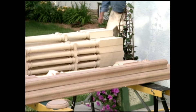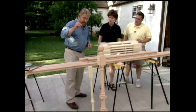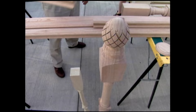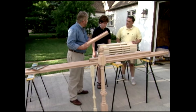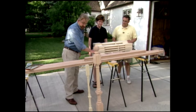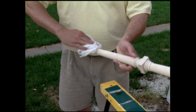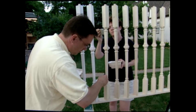I've laid out all the components for our railing system right here. There are really only three. This is a system by American Legacy. The three major components are a newel post, a series of balusters in between, and the whole thing is connected together with the railing. The newel post and the railing are in oak because you guys have a lot of oak in the house. But the balusters are actually in poplar and these are designed to be painted. As Steve and Stacy clean the dust off each piece with tack cloths, I temporarily nail the balusters to a strip of lumber so we can turn our painting into an assembly line operation. As the couple get started on the balusters, I begin staining and finishing the oak railing.